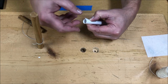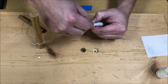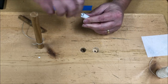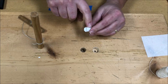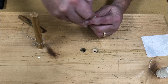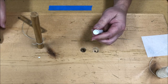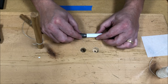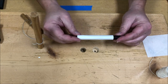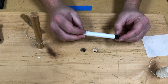Next, we want to twist and push down into the bullet-shaped cavity in the end of the mandrel. Pinch it all together and twist it in the same direction that you were rolling it — that really tightens up this end of the cartridge and locks it in place. Then take the former with the bullet nose end and push the end of the powder chamber outer wrapper down into that cavity. This provides a place for the nose of the bullet to go in the finished cartridge. Now we have a powder chamber that's nice and tight on the diameter of the mandrel.